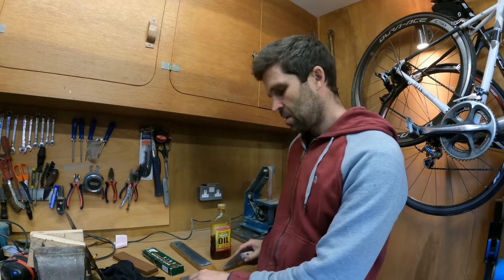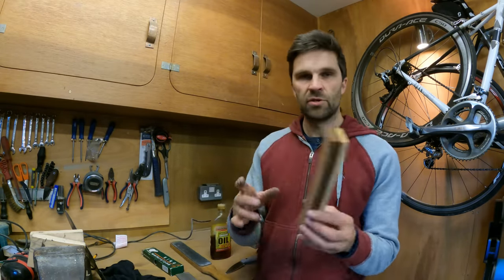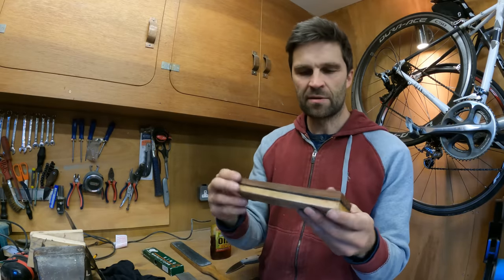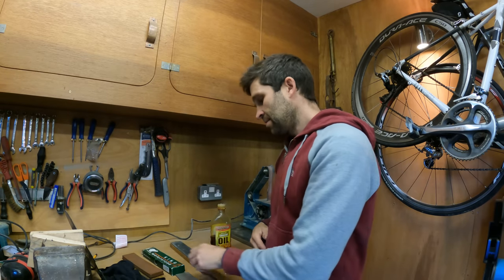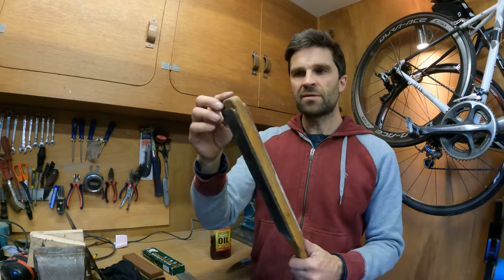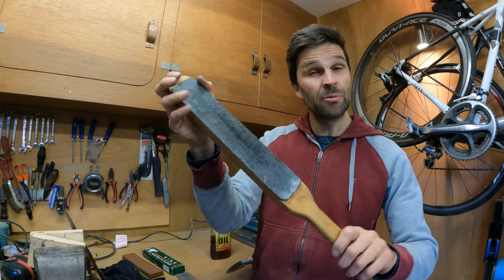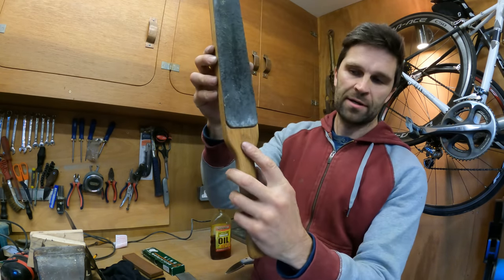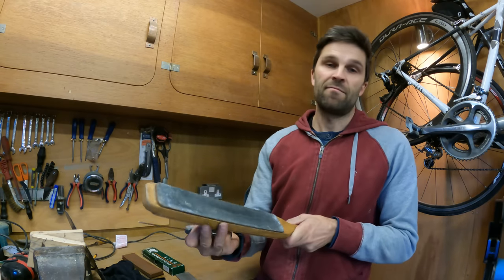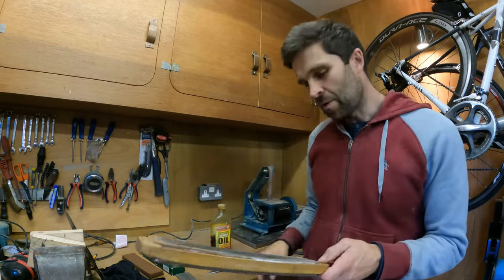I have sharpened it up. I started off using about an 800-grit diamond sharpening stone just to smooth it out, and from there I've moved on to a Japanese whetstone — my old tatty one that's completely bowed because I've used it so many times. I've got a nice new one which I use on my really nice knives. Then I've gone on to a strop: just a bit of leather attached to a piece of oak flooring — rock solid, you can shape it well. I've put a couple of indentations to fit my thumb so it fits my hand really well. I hold it against my body, push the blade along, flip it over to the smoother side. All you need is a bit of polishing compound to help shine it up and keep it nice and sharp.